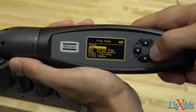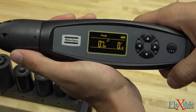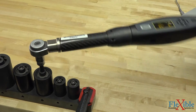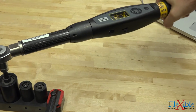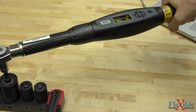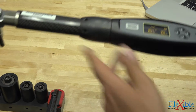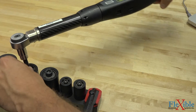Let's use the peak so we can quickly tighten the bolt and see what our peak torque is. We hit right and it brings you right into the menu. I'll attach my bit into the socket and begin to do a tightening. As we begin to apply pressure I'm going to stop at 25.5 Nm. I'll go ahead and work our second bolt also to 25.5 Nm. One's a hard joint and one's a soft joint.